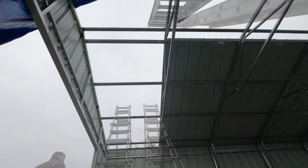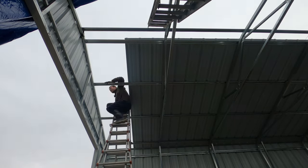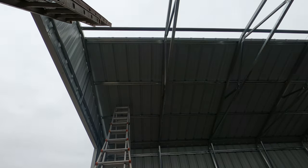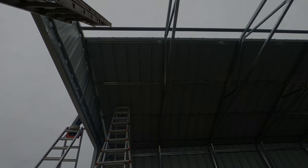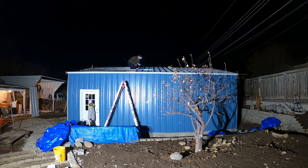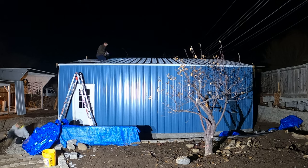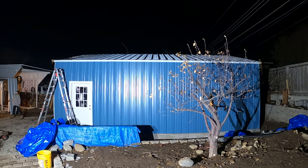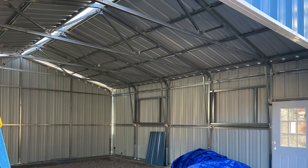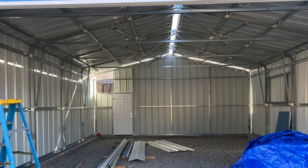The bottom edge of the roof had roughly a quarter-inch fluctuation over the full 30 feet, which really isn't bad — you can't see it from the ground. We maintained approximately a two-inch overhang which works well for shedding water. It's nice to see the building coming together. We still have gravel inside and still need to put the slab in place.